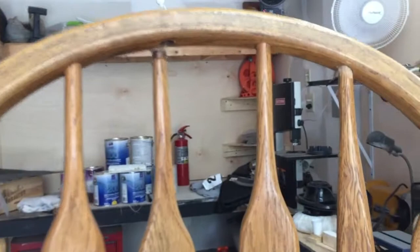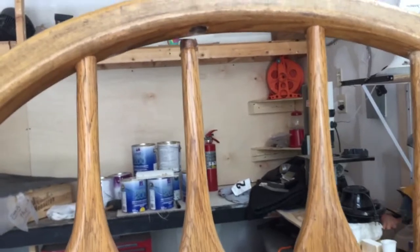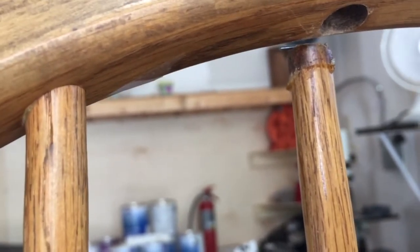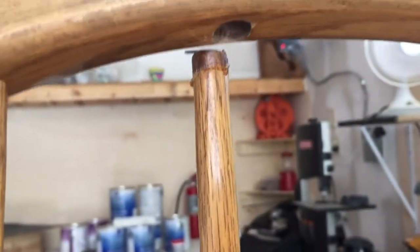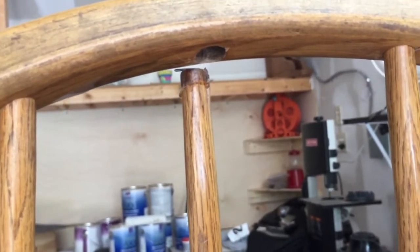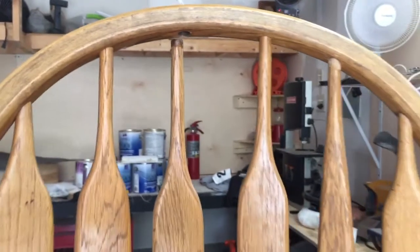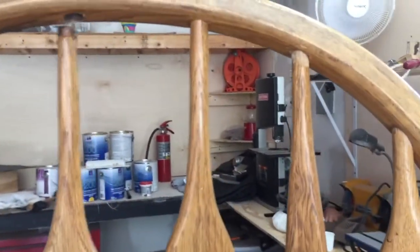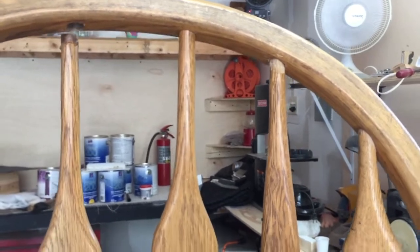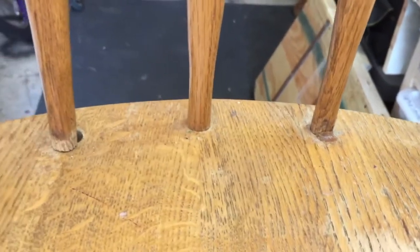The main problem is two things. One, the slat back — all these pieces here are coming out, which means the glue has probably dried out. And you can see that little staple they put there — that doesn't work, and it really never works. Often times they don't clamp these when they make them; they put them together and drive a nail or a staple to hold it while it's drying. So same problem down here — all the dried glue has to be scraped out, and these pop back in, and that's easy.